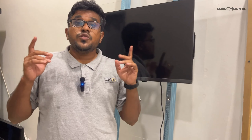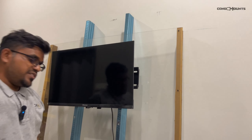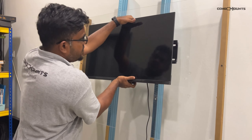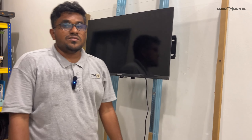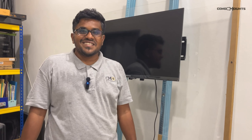Put each anchor in — slide it through the hole you just made and it attaches itself to the metal stud behind the drywall. To remove the clips, you don't need a saw or cutter — just move the clip up and down like this and that's it. Do this for all four elephant anchors. Now you're ready to place your TV mount onto the drywall.